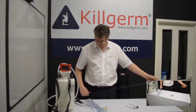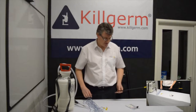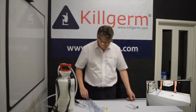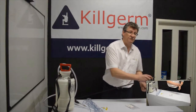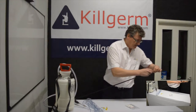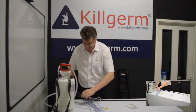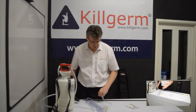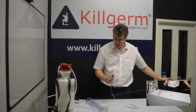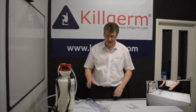We'll just have a quick look at some of the tips and advice on using the XL8 with the DR5 duster. One thing we will say, it's a good idea at the end of the season, or if you're not going to use it for a while, to connect the dust unblocking tool onto the end, disconnect your tubing from your DR5, and blow air from the airline through the entire system to get rid of any dust that's there.